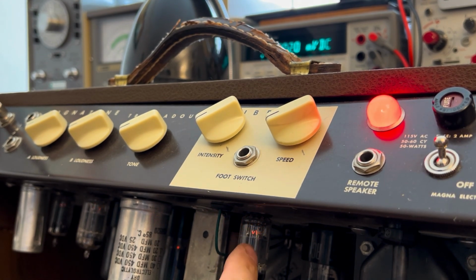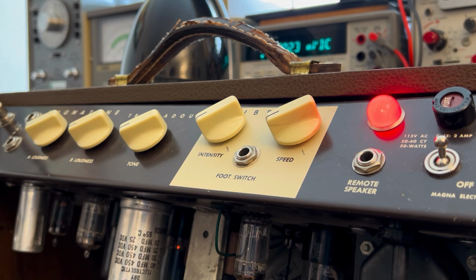So whenever you see a flash down there on the heaters inside of a tube, you know it's a European tube. It's a good little rule of thumb. And then as the current limiter starts to faintly glow amber, I could hear some 120 rolling in, or some 60. I'm not quite sure what that is. I think it's 120. So let's give her full power.